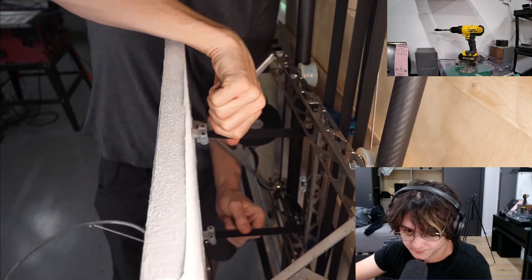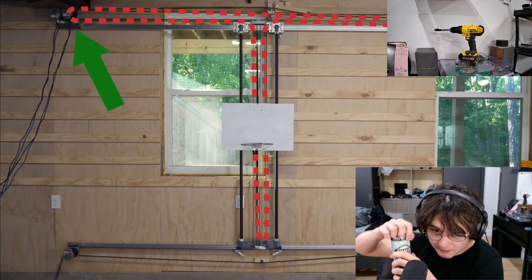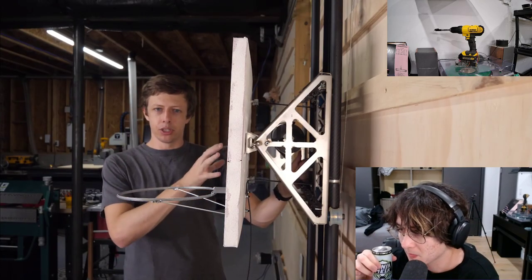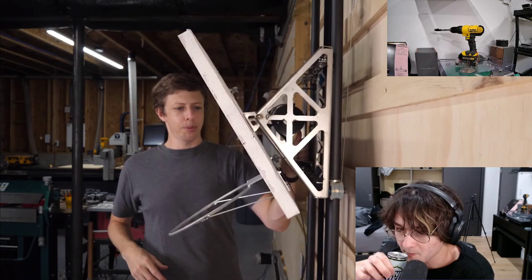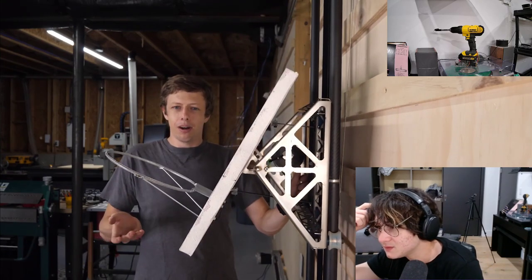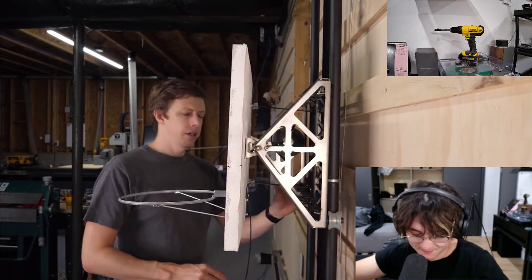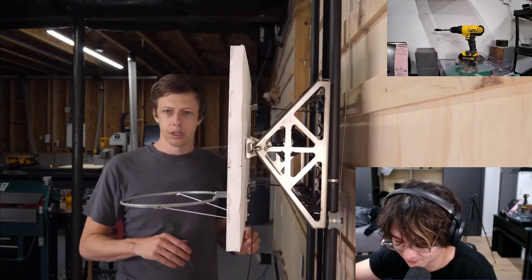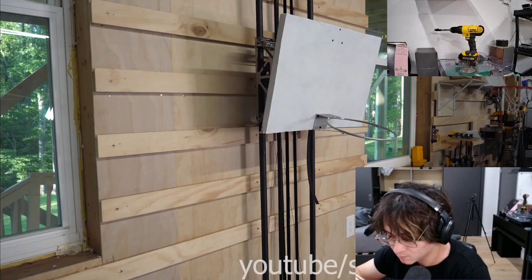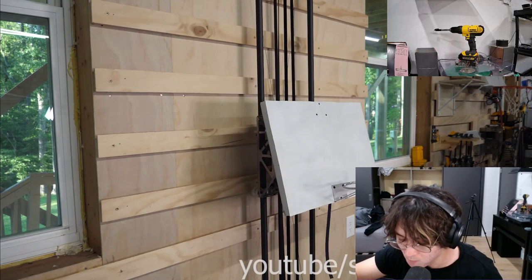To make it tilt, you pull on one belt and push on the other. The tilt motor follows a T-shaped path and connects to the second motor up top. The hoop is coupled to the cart position — if you pull the cart up, the hoop points down, and if you pull it down, the hoop points up. If I move the tilt motor, it tilts. If I move the position motor, it also tilts. So I have to drive them together in the same direction, and drive the belts different amounts to get a resulting tilt.